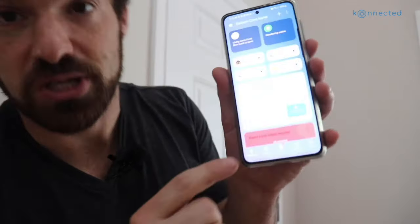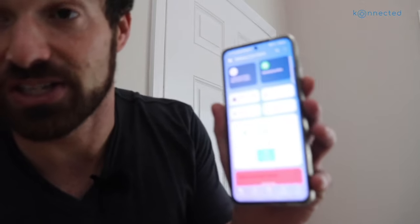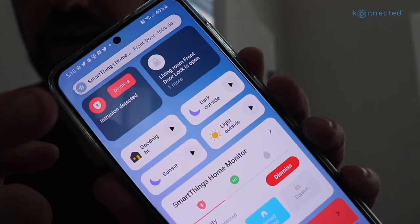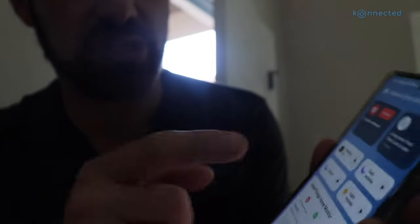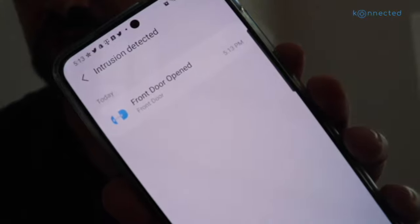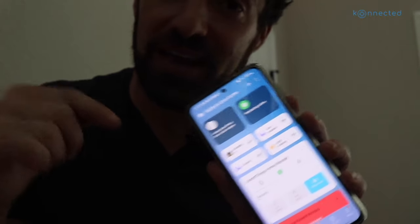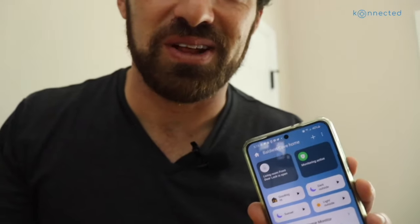I'm back at the front door — let's arm the alarm system in SmartThings Home Monitor in stay mode, which arms the perimeter. When I open the front door, immediately we get an alert on the phone. It's going to do that one-minute delay before sounding the siren, which gives me a chance to check. We get the alert that intrusion is detected — it knows my front door was open. If I hit dismiss, the siren won't sound, which saves my ears. We can see it worked. It really just took less than an hour to convert that old alarm system to a smart home alarm system with the Connected Alarm Panel Pro, connected by Ethernet and to SmartThings through Connected Cloud. Now you have free unlimited smart home monitoring with all the wired sensors already in your home.